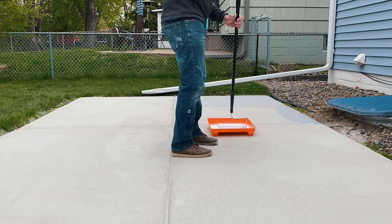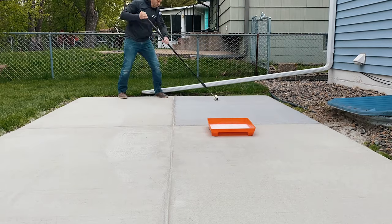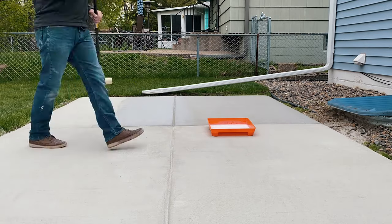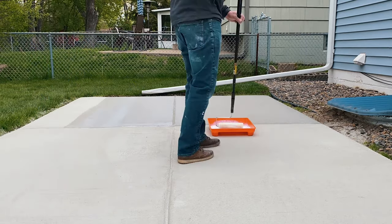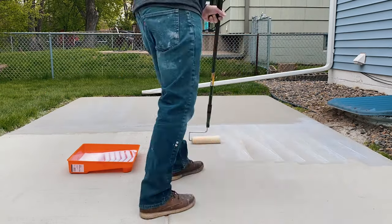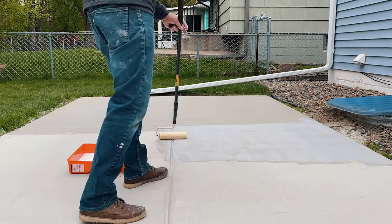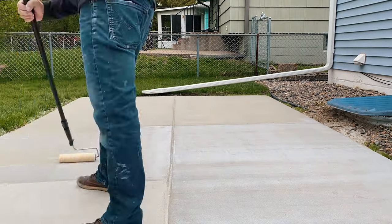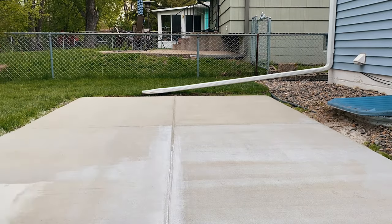For the final step, we're going to apply the water-based Bright Seal Sealer over the surface of the SureBroom. We're putting down one even coat — rolling and back rolling in two different directions to take out all of our roller lines and ensure a nice consistent finish. This will darken the surface of the SureBroom initially and then gradually lighten over time. Getting it down into the control joints as well. When you reflect back on the before picture versus the after, you can see that we've created basically a brand new concrete surface with SureBroom.